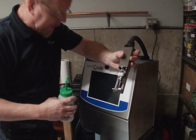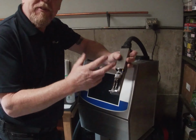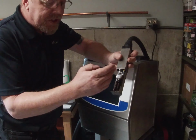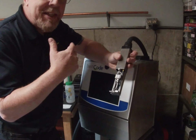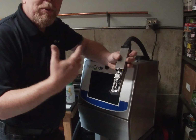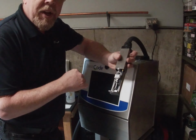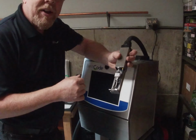Sometimes it's a little bit more than that, and that won't get rid of it. So if you've done five or six of those and you're still seeing the jet wandering, you're starting it and the jet's missing the hole altogether, and then you do it again, it's in a totally different place. That's what we call jet wandering, and we can fix that by flushing out the drop generator at the top here. So I'm going to show you how to do that today, okay?